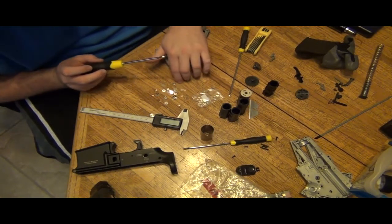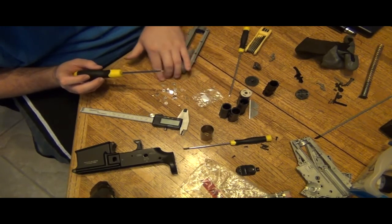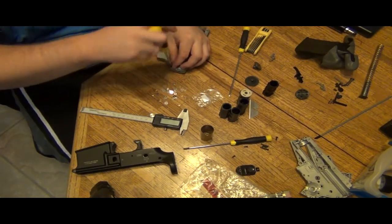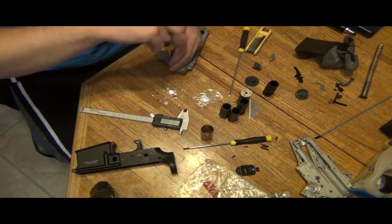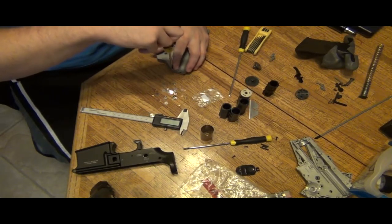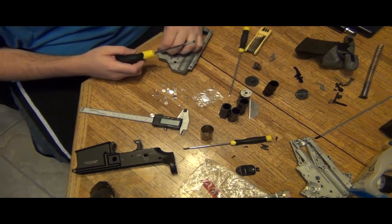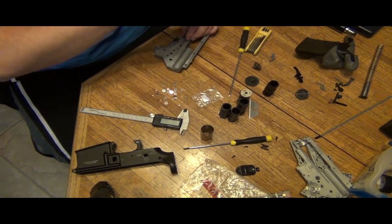I mean, just touching the shim, feeling the shim, that's not 0.02 there, that's 0.1. This is more like 0.2, which would probably measure to 0.15. I mean, that's things that you know just from doing it so often. Your experience kind of kicks in. And again, we kind of saw that because I just went really fast in adding shims on the top of that sector. I just went, boom, I'll just add this, I'll add that. I knew it was going to take a lot. I'm not going to waste a lot of time by trying to figure out, okay, is it too tight now? No, just keep adding them.